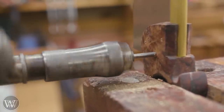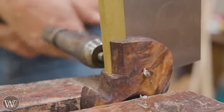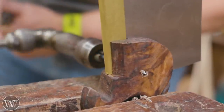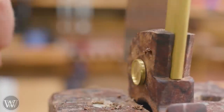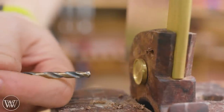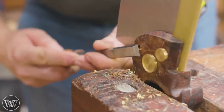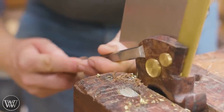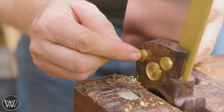It is a center bit that will actually make the holes. Once we get through the other side, we go back to a twist bit to go through the wood. We need all three of these holes, which were all laid out in the pattern from Blackburn Toolworks. The middle one is getting the medallion and the other two are just getting the normal split nuts - I'll have links to those as well. This particular one is mine, so I'm kind of experimenting on this one, and then the other two will be the ones I take a little more time and care on.